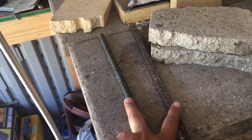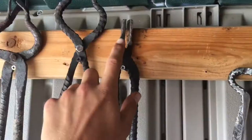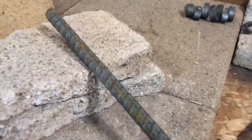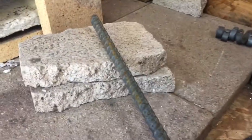So today we've got these two pieces of rebar. I'm going to be going over how to turn these into a pair of flat bit tongs like these ones, and then I may even do some forming at the end to turn them into round stock tongs. Each piece of rebar for the tong is going to be about 15 to 16 inches depending on your preference. You can make it bigger, you can make it shorter — it really just comes down to how long you want your pair of tongs to be. So let's get the forge all fired up.